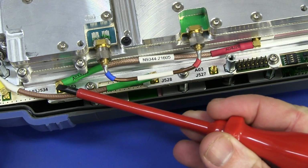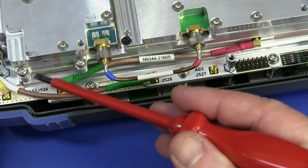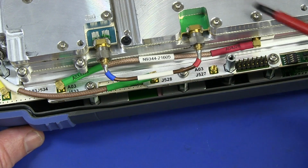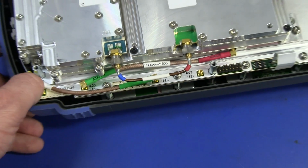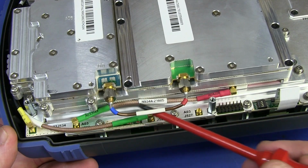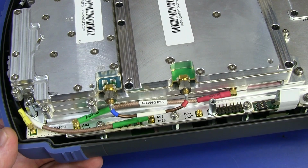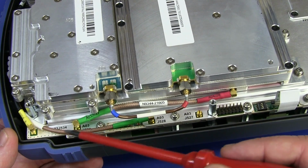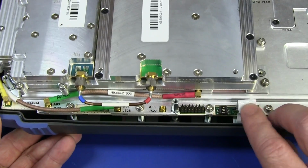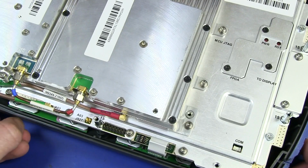Interconnect wise, we've got our main processor board here going up to that, which looks like the bottom. There's one complete board going across both of those modules. So I'm presuming the Spectrum Analyser module here and the tracking gen, that second board there goes all the way between the two modules. Interesting. Obviously you've got to connect the processor over to there, and we've just got some flat flex here going down to the keypad, display, some dip switches, and not much else.